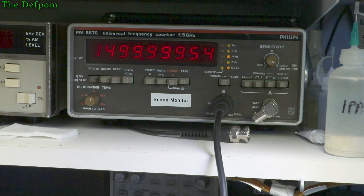An important aspect here is that all test gear has to be warmed up — it's all been on for a couple of hours to stabilize properly. Within about 10 minutes my test gear was reading about this value anyway, and it hasn't really drifted after that time. It's always best to have a soak time to allow stabilization, so make sure you do that when doing calibrations.